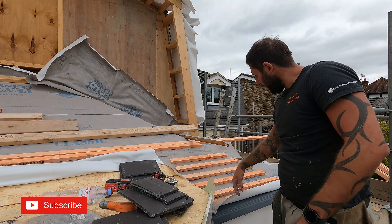This is a bit of a funny old detail here. So I've soaked it up the sides and I've just cut the welt off it and used it as a little cover flashing in there. Shame we started late today, we'd have had this done. Chris says it's going to piss down tomorrow about midday. So what I'm hoping is I'll get these corner bits, get the matting on, get the resin on them today, sheet it up tonight, come in tomorrow with the rolls ready and then I can just blitz that out - only take me an hour to throw that on. And then it'll be dry by 10 o'clock, it'll be solid, bone dry, ready for the rain. And I won't top coat it until all the tiling is done - just give it a sand down, acetone, top coat it.